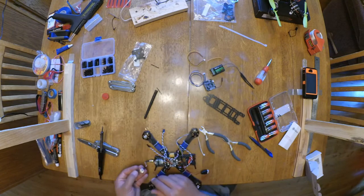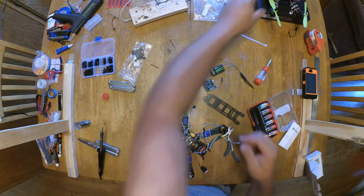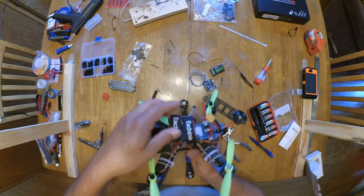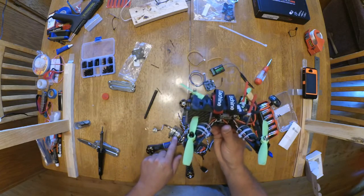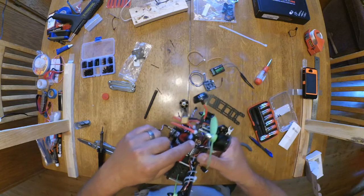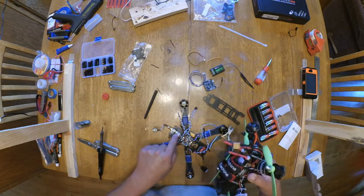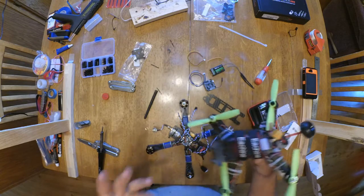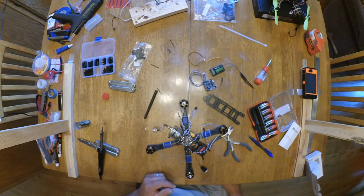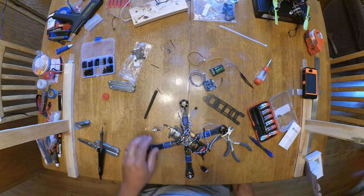That's where this broke off the other one — another frame before I replaced this one, so I didn't even put it through there. I'd almost like to do the same thing. But this video transmitter, the 600, comes out the bottom, and the 200 is a lot smaller. Shorter, and the wires come out the side so you have a lot more room. I wouldn't use the 600 — I don't know why I ordered it. I was trying to get more range, but my transmitter has only got so much range. My video will already out-shoot my transmitter, so I don't know what I was thinking.